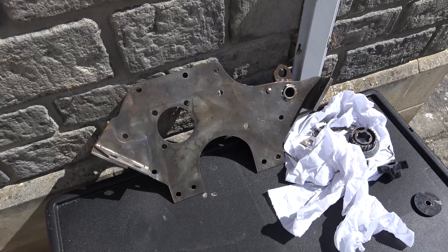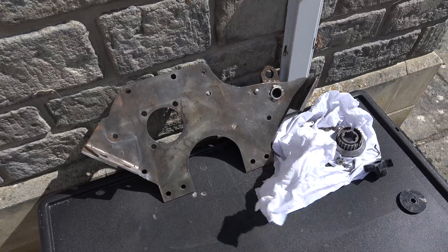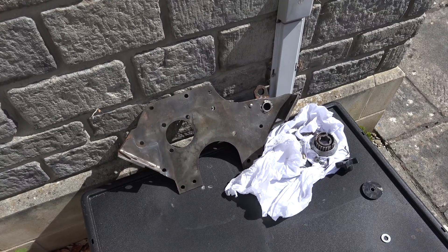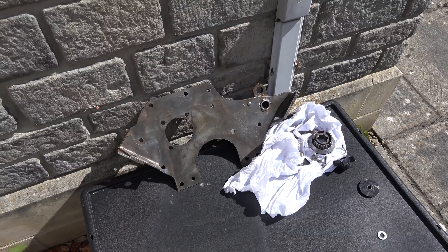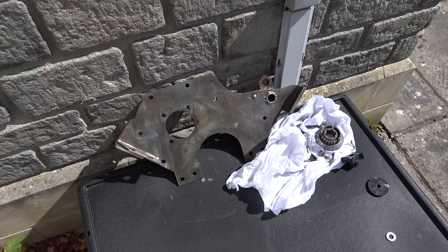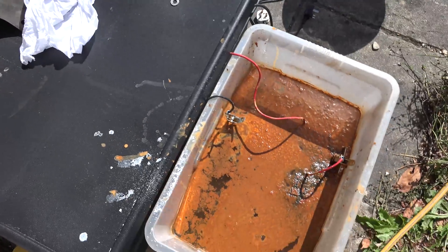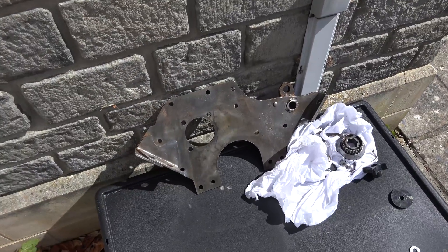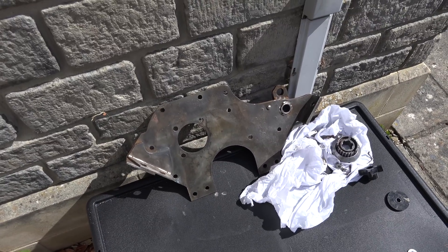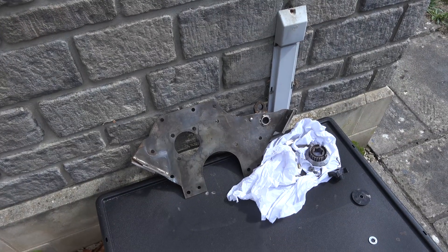It's practically magic - that was a greasy piece, we hadn't removed any grease or paint, and it's just worked perfectly. I'm really impressed. For a flat plate you could do manual cleaning or blasting, but when we work on the block we need to get inside it and we can't do that any other way. Electrolysis is the way forward. It's also cheap - you need a battery charger, some sodium carbonate, a tub, and electricity to run it. Not expensive at all. I hope you're happy with that - I'm pretty pleased. We'll move on to more things in future, but for now guys, I'll see you next time, thanks a lot.